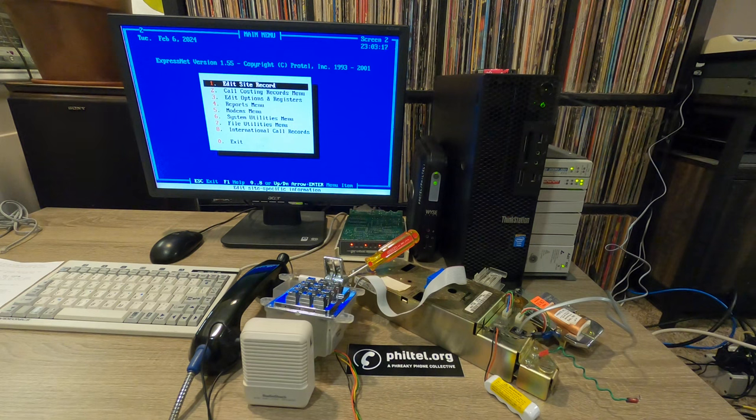So you can see that they can take a certain number of cards, which makes them really highly configurable. Mine has a TDM controller at the top to actually use with the T-Carrier communication. And then the second card down is an FXS card. So that gives me 8 FXS lines. FXS lines are subscriber lines. So I can essentially hook 8 different phones or extensions up to this with this one card. I could put more FXS cards in here.